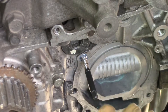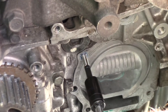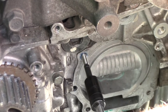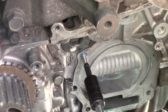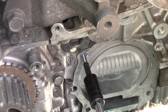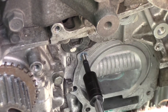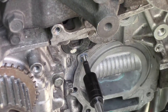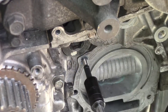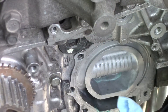I put the insert onto the driver tool. On the outside of the insert, I like to use a little thread locker — it helps lubricate it as it's going in. There it's pretty much seated. Now we need to drive it the rest of the way in. You just got to be careful that when it stops, it'll get tight, but then it'll totally stop when you hit the end of the hole. You'll feel resistance for a little bit because it's expanding the insert to bind it into the hole. Then it'll get easy — it's getting easy now. I just felt it bottom out. Let's take this out. The insert will remain in while I remove the driver tool. Good as new.